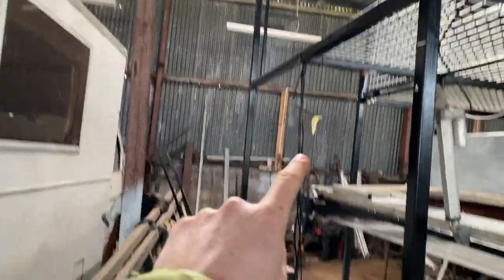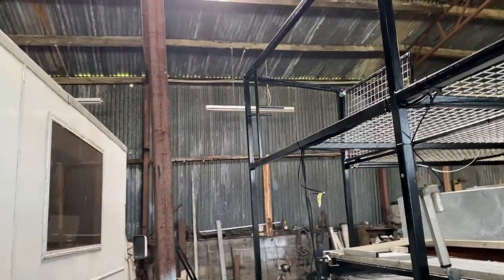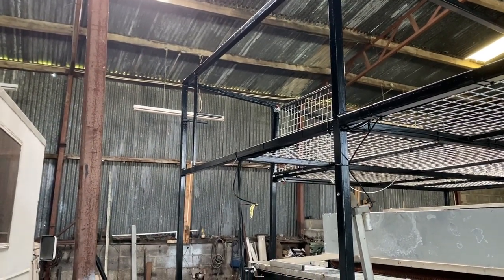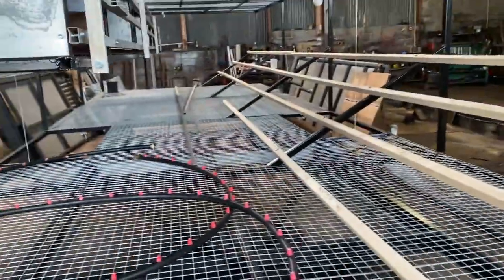We've got all our wiring in, got it all tucked up nicely and cleared up. I'm waiting on one actuator to go in here and I've got to run a wire over and match them up. Everything else will be done down here and all the wires run up to here. My box is going to sit just under the battery. I'm going to put an external camera on and make a bracket to mount the solar panel on the roof. I'll put on the cladding first, then my solar panel and a camera bracket for outside. I've got my motor — I need to wire that in for the egg belt. I'm waiting on some sprockets; there's a key on the motor and I'm waiting for a sprocket that'll fit the key so we can put a little chain on it to drive it.